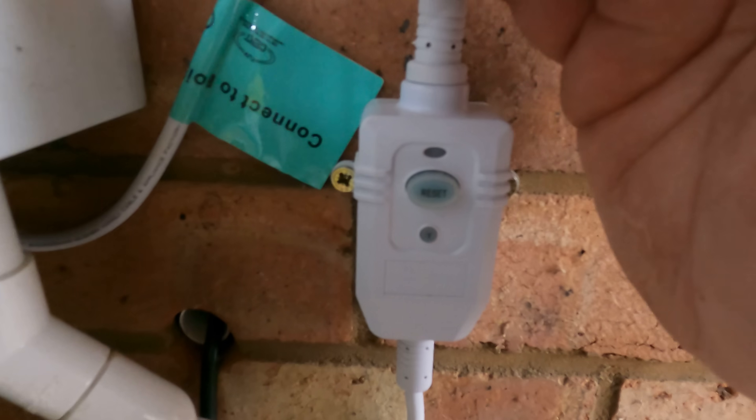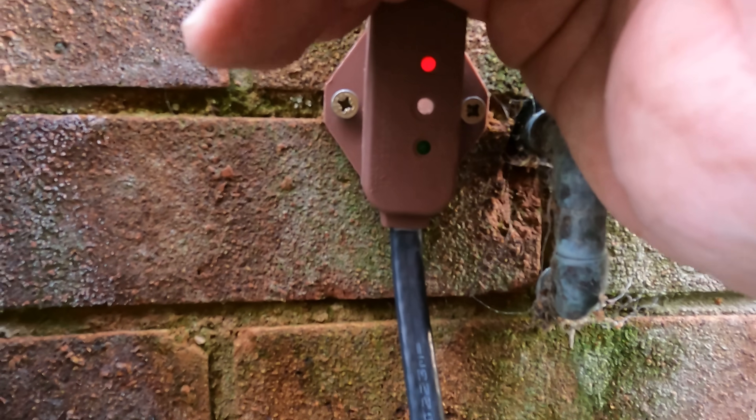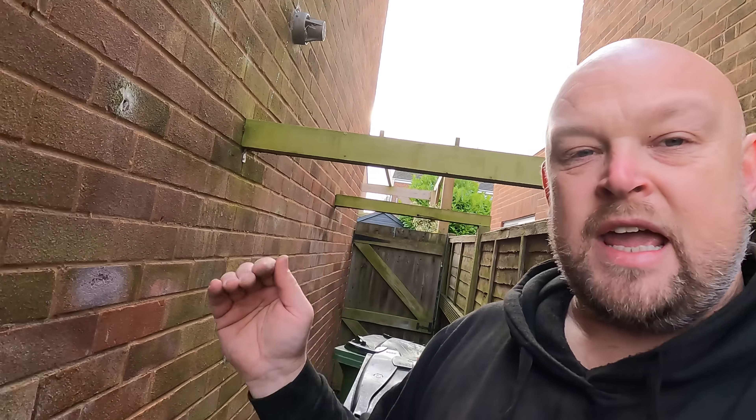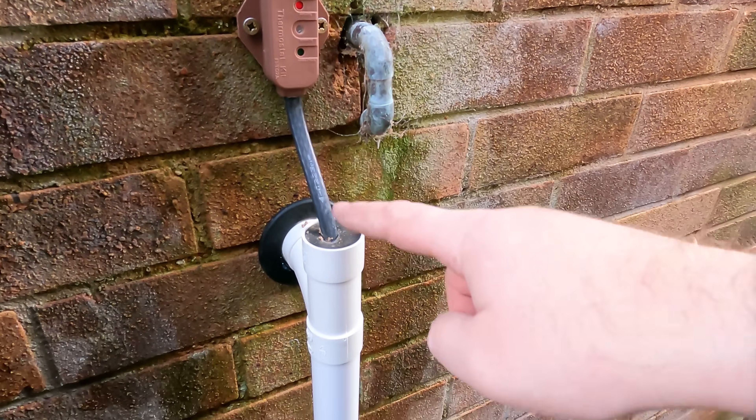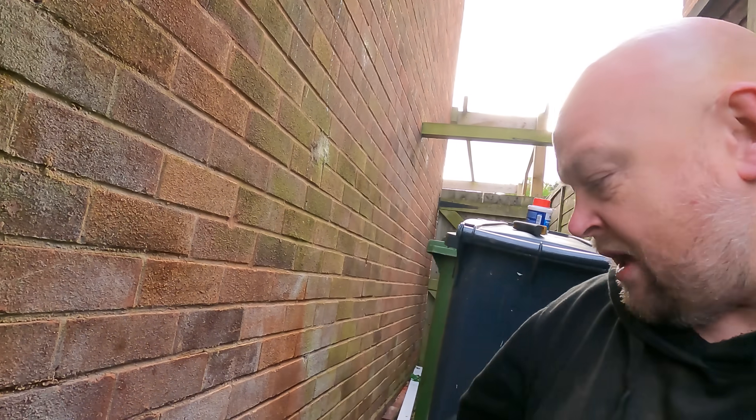With the boiler trace connected into the power feed to the boiler, the boiler's off — we'll turn it back on at the board. Power's back on, and we have our red light on at the test point. Then going outside, we've got our thermostat and you can see our red light on there. The green one isn't on at the minute because it's not under three degrees yet, but as soon as the temperature in this little alleyway hits three degrees that sensor will pick it up, the light will come on, and it will send a current down the trace pipe to keep the condensate water warm so it doesn't freeze up. All we've got to do now is get the lagging on and fit the warning notice.